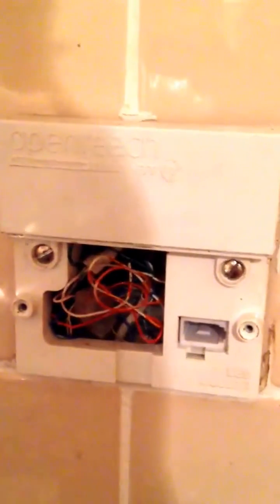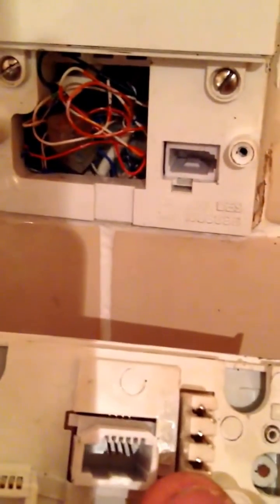If you haven't replaced your filters for a while — if they're 12 months or older — then replace those. You can also find that a faulty phone will cause broadband dropout. There are quite a few things that will cause it. If you've got a phone plugged in without a filter, that will also cause it. Normally blue and white goes to two, white and blue goes to five. What I would do is change it so that you've got orange and white on two, white and orange on five, and then go around the sockets and do the same.